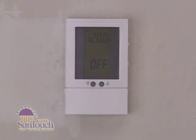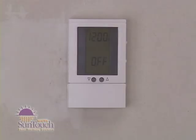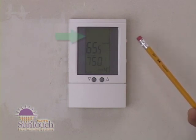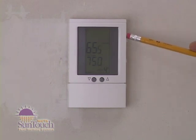Now, here are some basic programming features for your control. Quick setup: your thermostat should be turned off and the display will show 'off' along with the time and day. Slide the on/off switch to the upper position to turn the thermostat on — the display will show the time, day, temperatures, and other information. To turn the thermostat off at any time, slide the on/off switch to the lower position. No heating will occur and all your programming is retained.